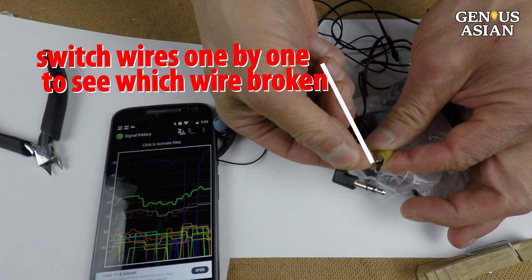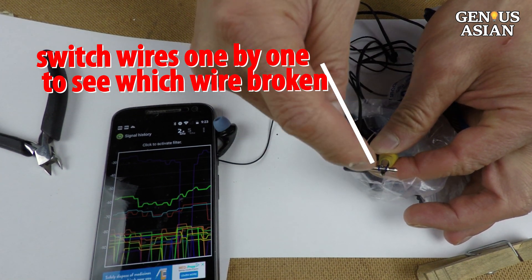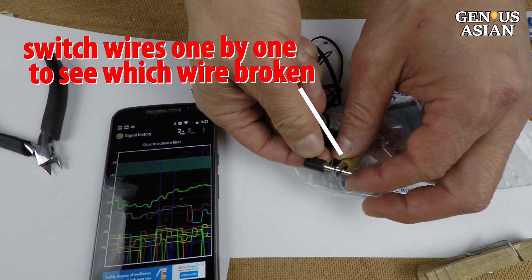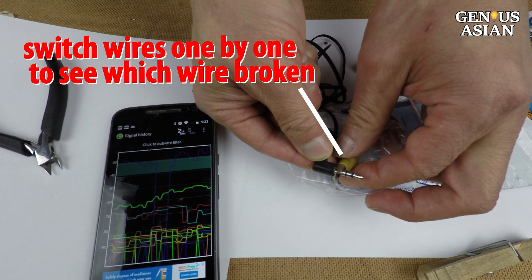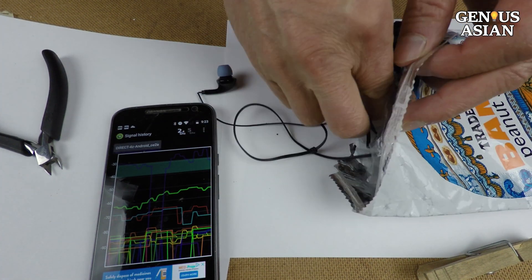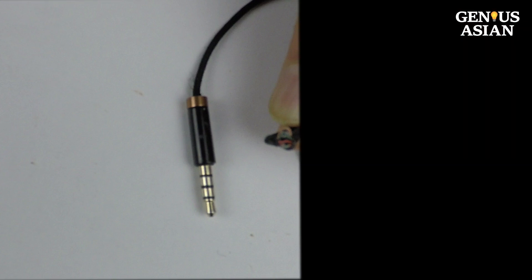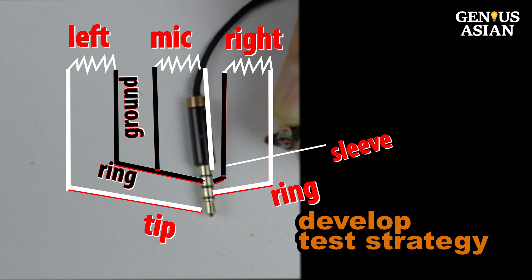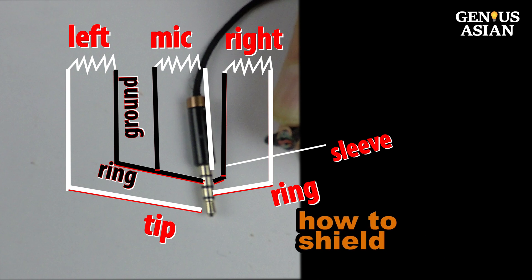For any suspected broken wire location, connect the wires one by one to the antenna to see which wire may be at fault. Regardless of whether you are able to separate the wires, since the wires are still connected to the loads such as the earbuds, you may get unexpected test results. This diagram shows the continuity of the wires and will help you develop a testing strategy — including test sequence, which part to shield or expose, and help you predict the result.